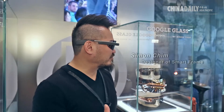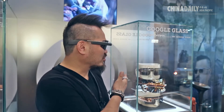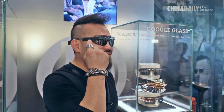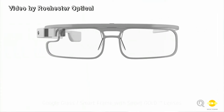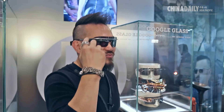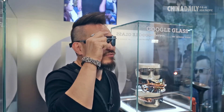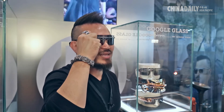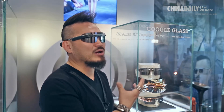When you design frames or lenses for Google Glass, you have to follow what is already there. For Google Glass, there's an eye-bar, and this has come with the Google Glass that we cannot take away. Rochester Optical has developed a system to lock the frames onto the bar. So this is what we have to follow — to design the mechanisms and frames to work together with the locking system, and also to avoid certain obstacles for the sensor inside that is used for sensing your blinking of your eyes. We have to work on the design to accommodate all these obstacles and barriers when we design the frames for Google Glass.